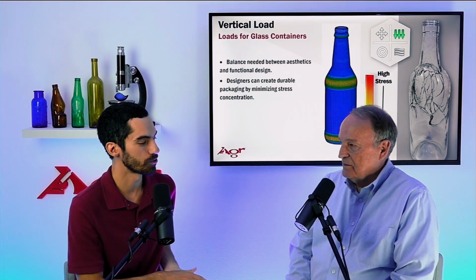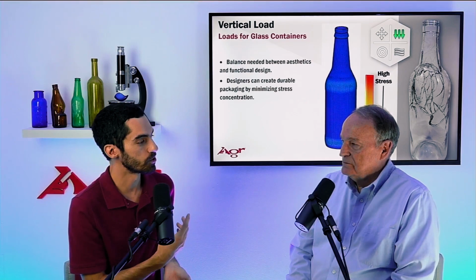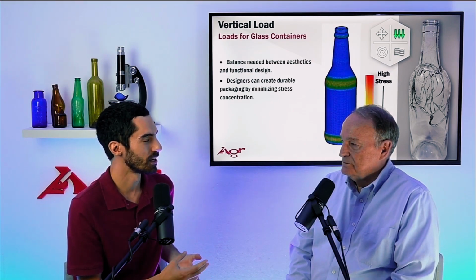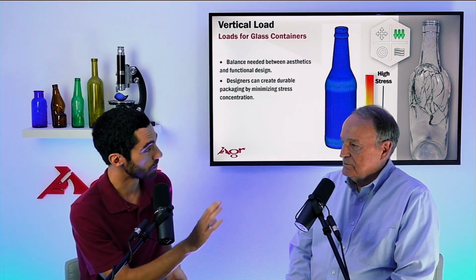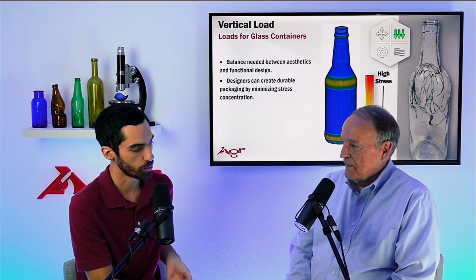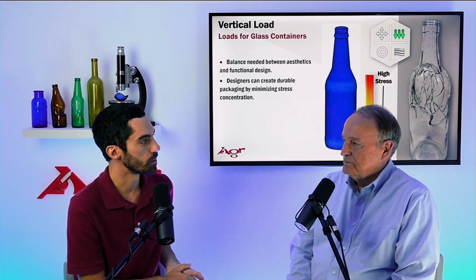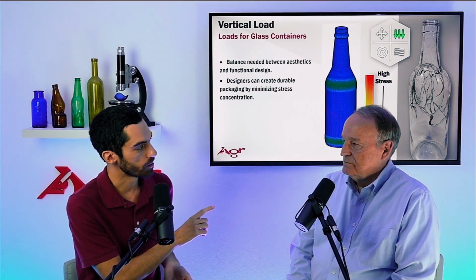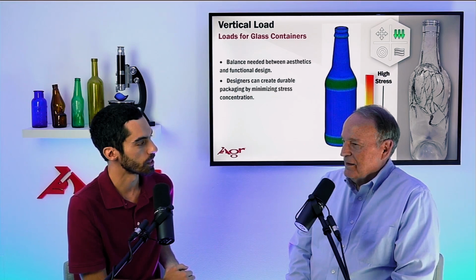We have that pressure, that thermal shock to find those flaws. So even if we consider it from a quality control test, we got better things to do. In terms of testing it for a design and making sure it's acceptable based on operating conditions, we got a pressurized container, it's a long neck beer bottle, whatever the case may be, we should still be abrading it off the leer or simulating the damage in one way or the other to test.